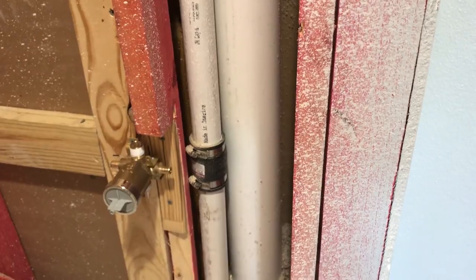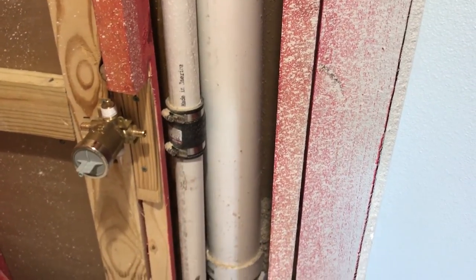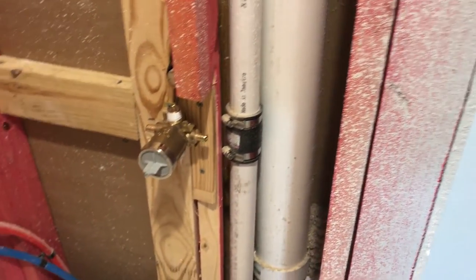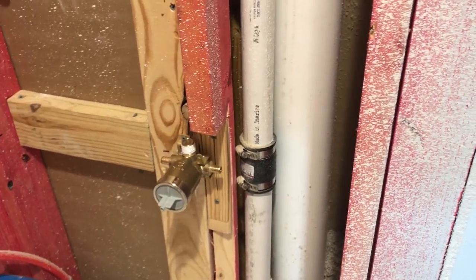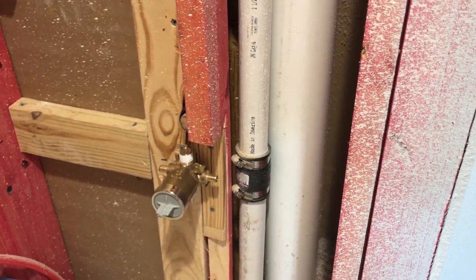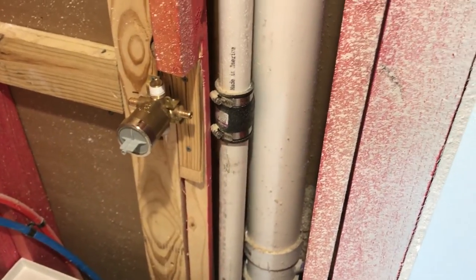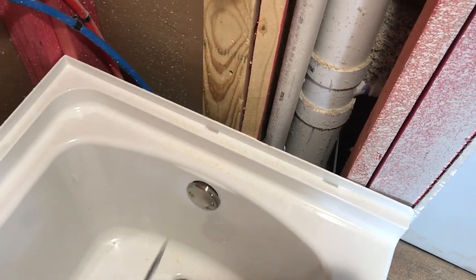So we got our pipe moved. I just left about a three-quarter inch short so I had plenty of room to put the pipes back in. Glued everything except for this one over joint — put the sleeve on and slid it all the way down over one piece of pipe, then glued them in place and slid it back up over the joint and got it all torqued in tight. It's a vent pipe so I'm really not worried about any liquid ever going through it. Got the tub set in here again to look at it, and got my mixing valve put on. Now I can go ahead and run my plumbing up for the shower head and run it down for the tub fill spigot.